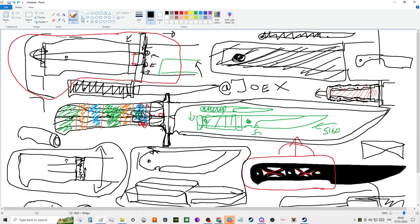These half tangs. Sometimes the best thing to do is just to glue it in like this and don't put any pins. And with the modern epoxy, most of the time it's more than strong enough. A lot of these parangs, a lot of these machetes that are being used every day to cultivate fields and cut sugarcane and stuff like that, they're just stuck in with glue, nothing else. They don't have a pin, they don't have a peen, nothing else like that. They literally just glue it straight in, and it works perfectly fine for them.